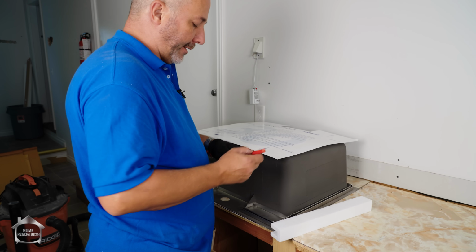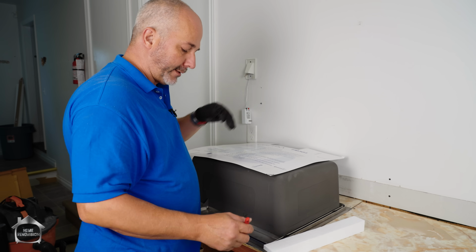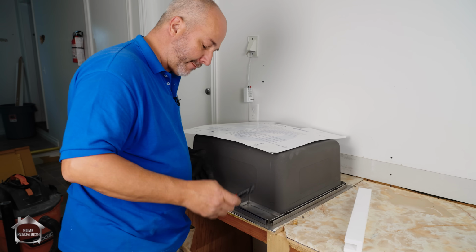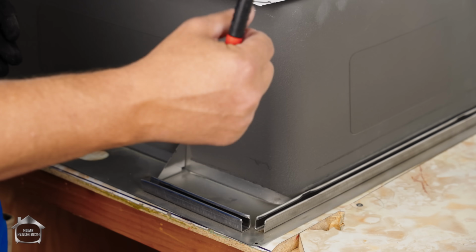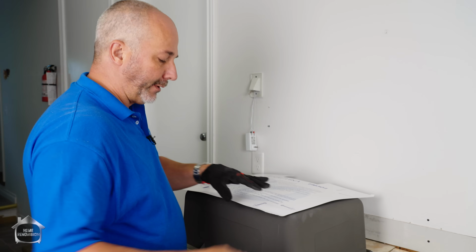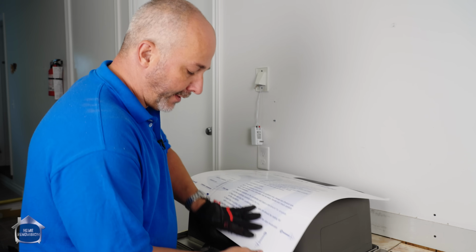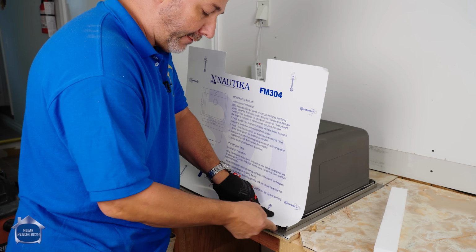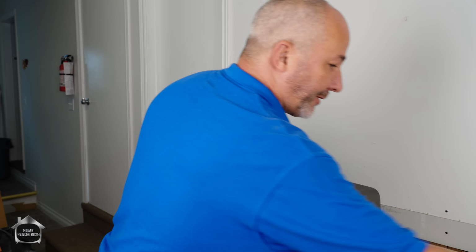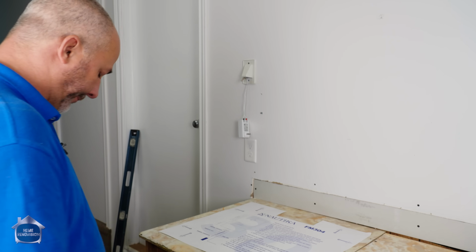I'm gonna trace it out of my countertop. I'm gonna round off all my corners, okay? Because I don't wanna have a countertop that's so close to perfect when I'm cutting natural stone. If I overcut, then I'm gonna have a little gap with grout in it. It's gonna look nasty. So I'm going to just cheat a little bit and put less countertop. So I'm gonna have more countertop in the corner than what they're asking for, knowing that even if I round it out, there's nothing in the way of it, okay? That's just experience talking.